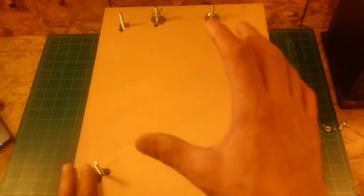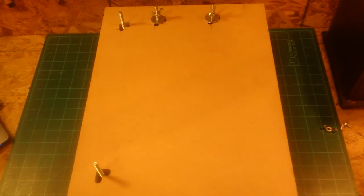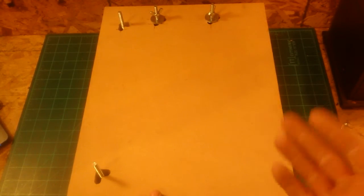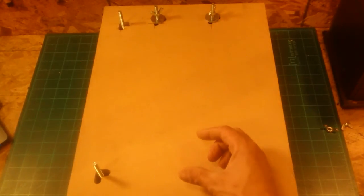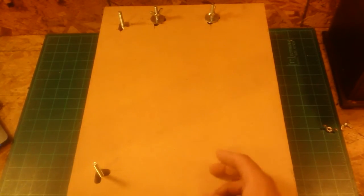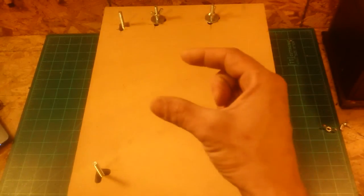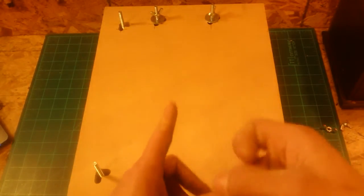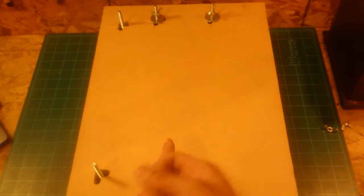If you have foam laying around the house, a good way to test whether it's heat resistant, or whether the foam is going to break apart and stick to the Kydex because the heat's too much for it, is to take a little corner piece of that foam and a piece of Kydex, say a 1/4 inch sliver about the size of your pinky, 1/4 inch by a couple inches. Lay your foam on a piece of wood with the Kydex right on top of it, and then take the heat gun and cook the crap out of the Kydex.